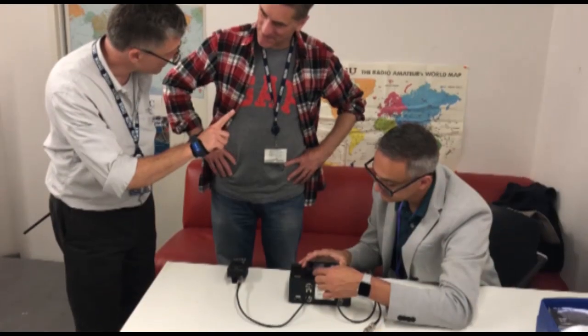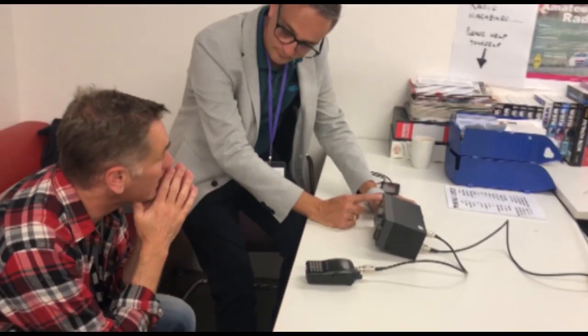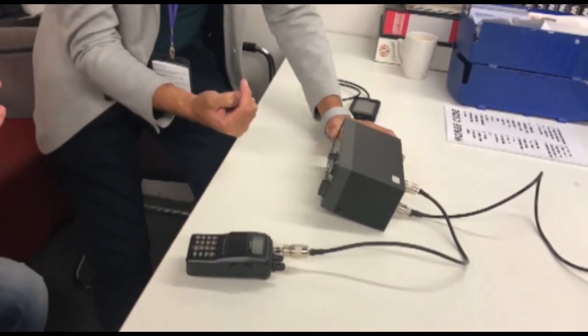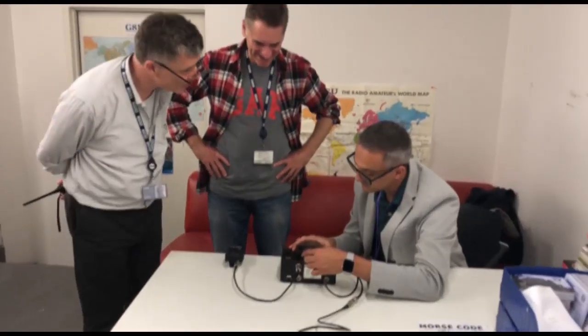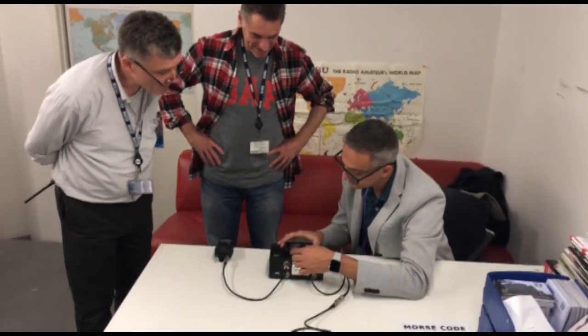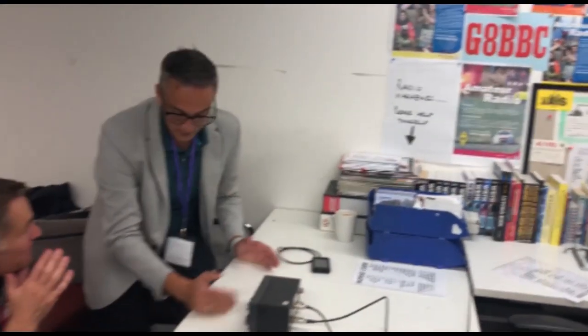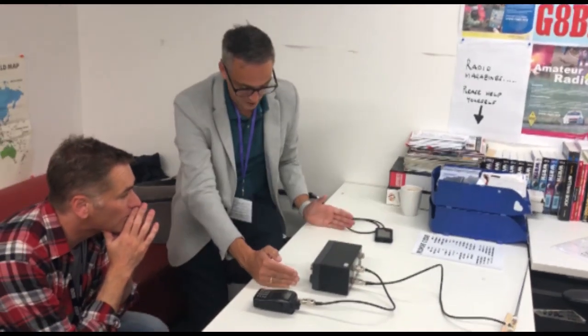Excellent, and you've done some practicals, so we spent some time with you at Broadcasting House. Can you cast your mind back to what you did there? Yes, and what a fun afternoon that was. As part of my foundation license, one has to do a number of practicals. The first one, as I remember, was tuning a dipole, with a bit of help from you and other members of the G8 BBC club in the shack — just getting that SWR ratio of one-to-one with the dipole.